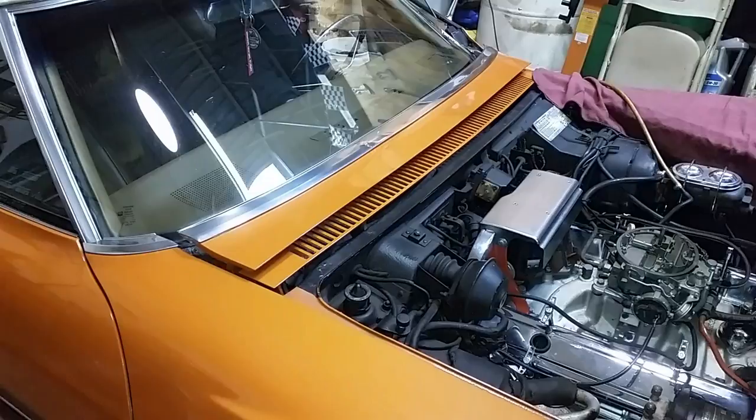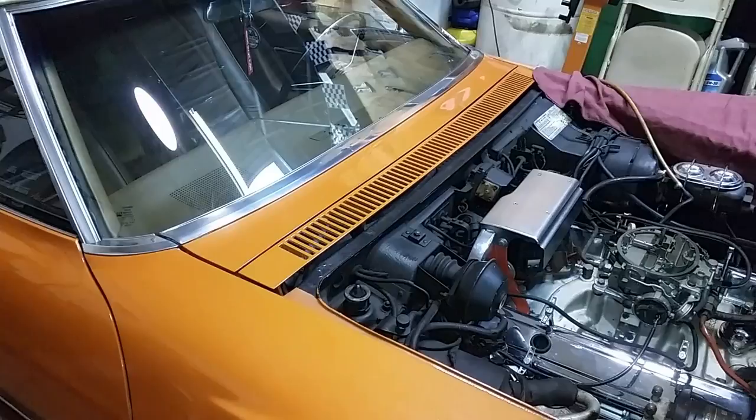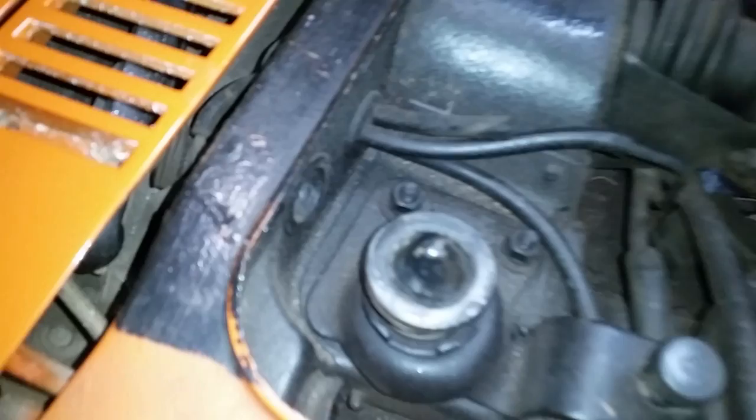The cowl works perfectly. Now I do hear a slight hissing, so we might have something leaking in that area. Just because it works doesn't mean that it doesn't leak vacuum. I'm going to listen around the cowl to see if I can find a leak. Going around the car, I can hear there's a pretty good leak coming from in there. That right there is the vacuum valve that operates the cowl. When the wipers come down, it hits a pin right at the top there, which diverts vacuum and allows the cowl to pop up or pop down. I still hear leaks down in there, so we could have a line issue or we could have an actual valve leaking.